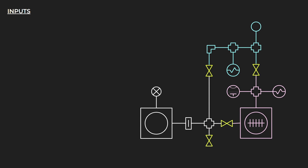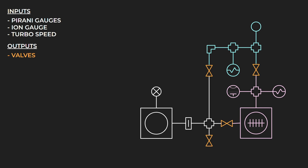In order to sense and control the vacuum system, the controller will need multiple inputs and outputs. Both Pirani gauges as well as the hot ion gauge are connected to a vacuum gauge controller which has analog outputs wired to the controller. In addition, the turbo molecular pump has a proportional speed output which will allow the controller to know what state it's in, and we can use that speed as a sort of fault detection — if the turbo pump suddenly starts slowing down for no apparent reason, it's probably the turbo controller trying to protect it from some kind of fault. For outputs, the controller will have control over all of the high vacuum valves and will be able to turn both vacuum pumps on and off.